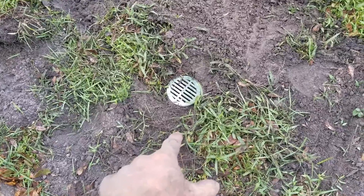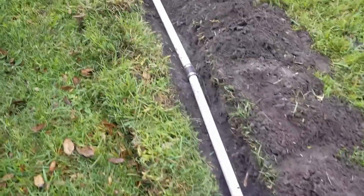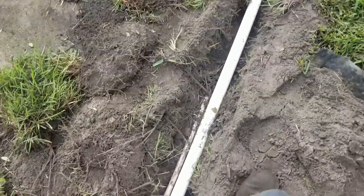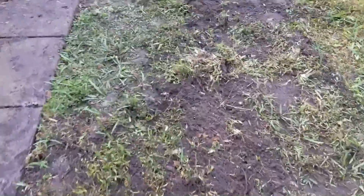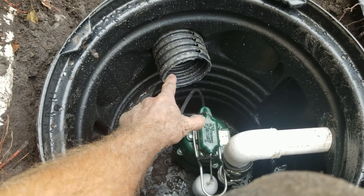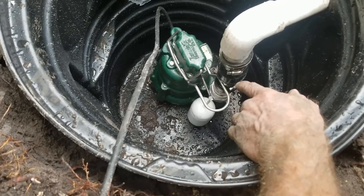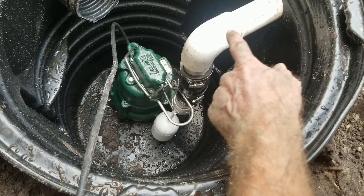Here's our discharge. We decided to use just a four-inch grate because it's under pressure — sometimes it blows the pop-up off. We've got inch-and-a-half PVC that runs all the way back. We're backfilling that right now. This discharge line only has to be a few inches deep — six inches is plenty. We do have a broken irrigation line; we'll make a repair to that. You can see how you can set your sod back on nicely. It did rain on us so it's a little muddy. Let's take a look inside the sump basin before we close it up. We tunneled underneath the sidewalk — line goes over — and we've got the inlet line that comes in, picking up the French drain in the backyard. This is a Zoller M98 half-horsepower pump — very powerful. We've got a check valve to only allow water to flow one direction so water can't come back down the line.